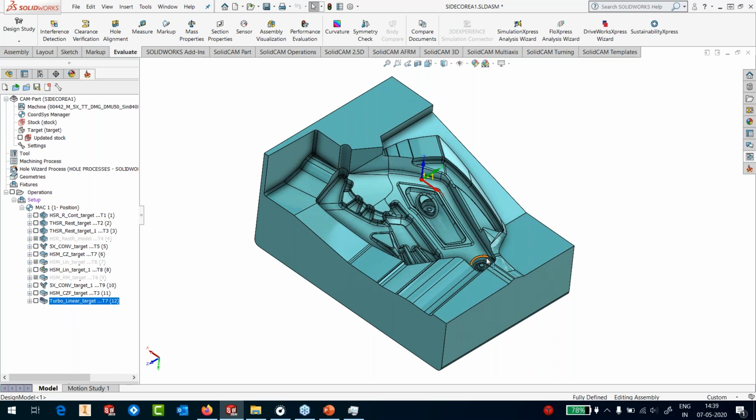Since iMachining works only with solid carbide end mills, we have to understand that solid carbide end mills end at diameter 16. You also have 20, 32 also, but they are very, very expensive tools. Okay, so economical end mills stop at diameter 16, and if I use diameter 16 for, let's say, this part, I'm actually going to increase my machining time, even though I've put iMachining.